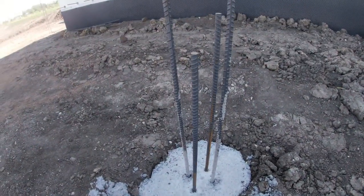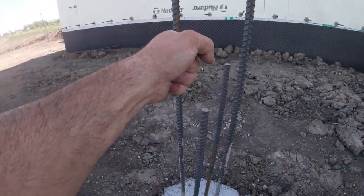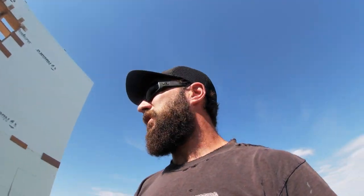That's that cardboard circle tube. You've probably seen it all over construction sites. Sono tube is what it's called. So we'll build that up to wherever it needs to be at the height of those dowels. Slide some longer rebars in here, and then we'll bend those over so that the floor is sitting on piles, and that should be a good strong floor. You could drive tractors on it without worrying about it. Whatever you want to do, right? You could bring some heavy tools in, shouldn't have to worry about it because the floor is all supported on piles.